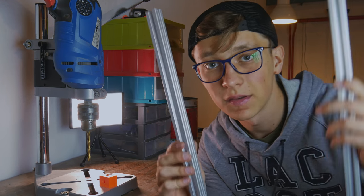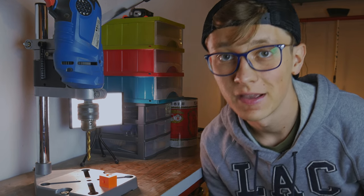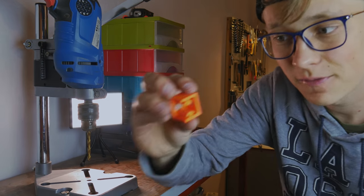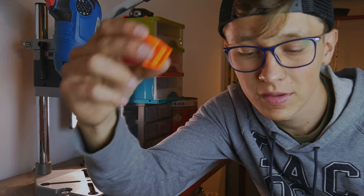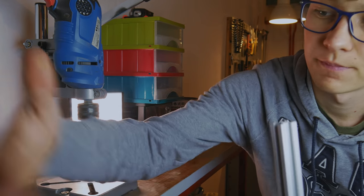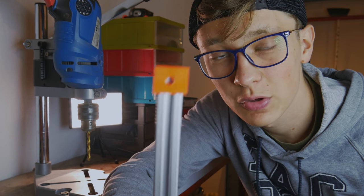After making threads in the smaller aluminum profiles, we have to drill holes in the longer aluminum profiles. For that there are two super useful things: first, a drill press — even the simplest, cheapest one — and second, a 3D printed tool. You can find this tool on my Thingiverse page for the Dremel CNC project. You put it at the end of the aluminum profile, and now it's super easy to drill a hole perfectly where it should be.